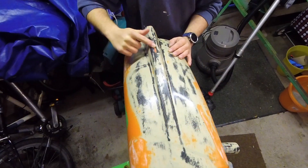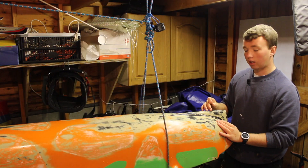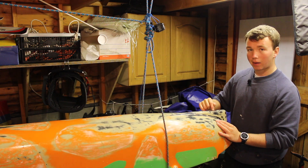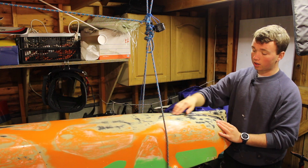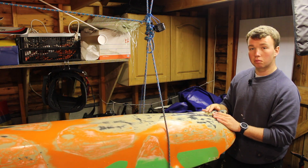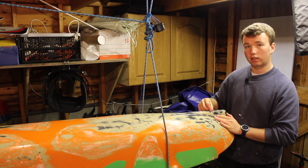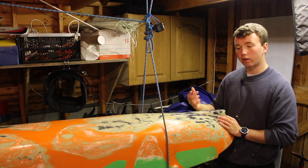In some areas we had a bit of a gel coat repair, which wasn't ideal, but we put it in because we didn't know whether it was leaking and there was a bit of a low point. I'll grind this out and then lay it back in properly, probably with a bit of epoxy and carbon, to make it really nice and smooth so it's hydrodynamic and looks good. When the paint goes on top it's going to be a nice, smooth, and hopefully invisible repair. As we go through the boat we'll note down where these marks are so when we come back to do the repairs we know exactly where the repair sites are.